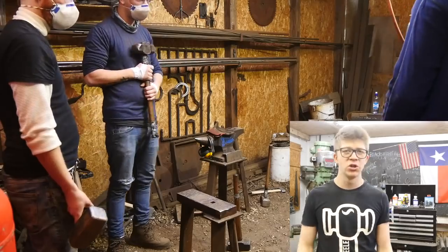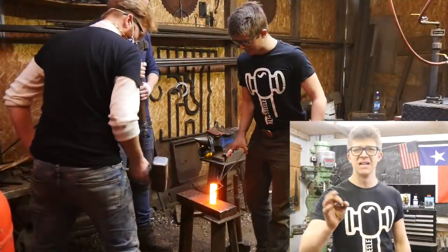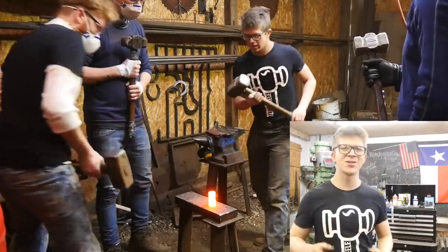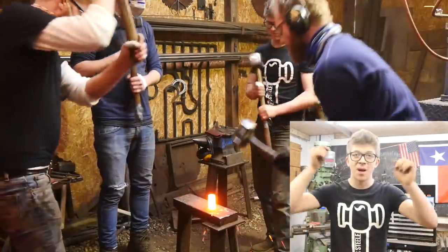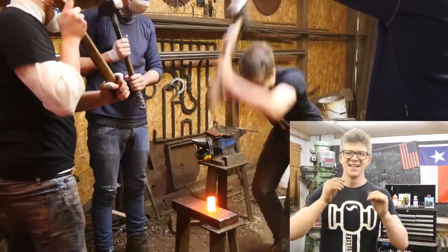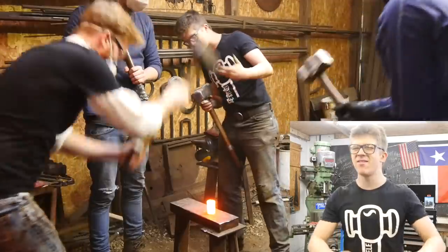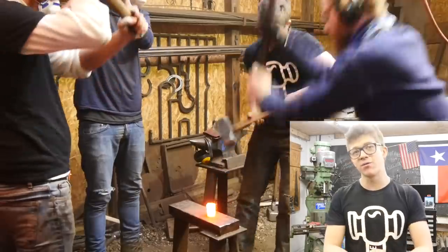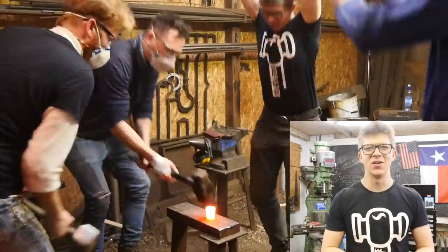It's a really nice tool to forge. Of course, we match it up to the top fuller. From there, we're going to move on to a cupping tool — one of the funnest projects here, because it involves learning to work with a group of strikers, learning to work with four strikers in a team to upset this piece without running sledges into each other. It's a tremendous amount of fun getting the rhythm. We start gently with the hammer and then follow the lead, pace, rhythm, and power of the director, hitting harder and harder as we go, bringing the cupping tool down in shape.